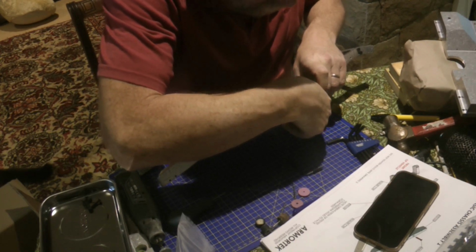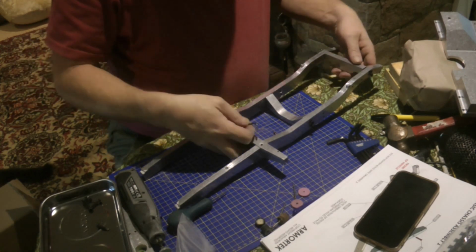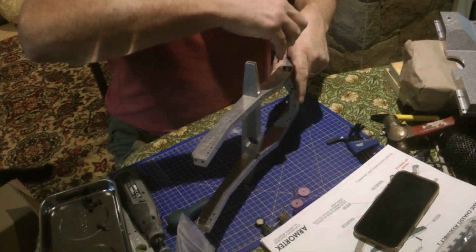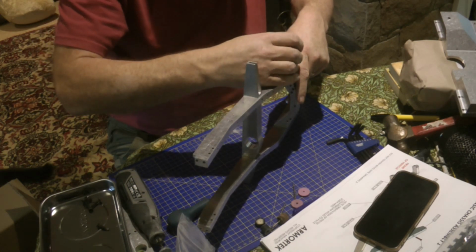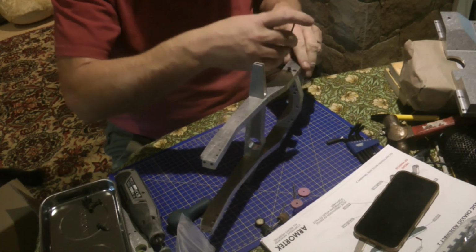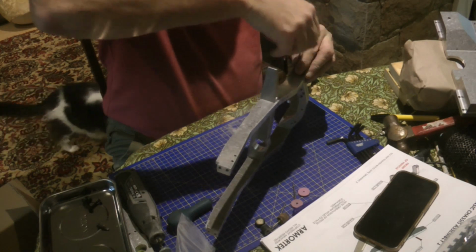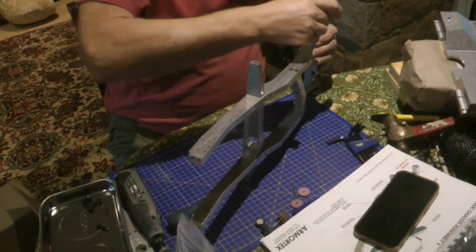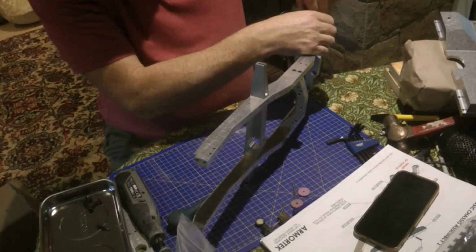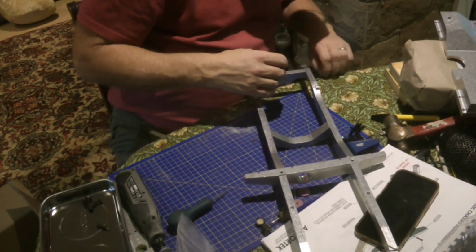Twenty, I can't remember now, M4 by 20 screws. I'll tighten them up just lightly tight, just to give the chassis some degree of rigidity, just to make sure that cross member is going to be in the right place when I screw that one in. Probably just loosen them off again a little bit once I know that everything's square, because it says do not tighten till drawing 2.